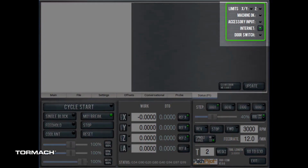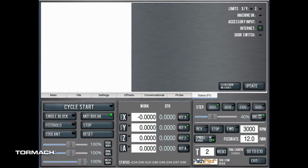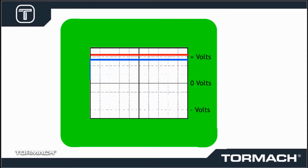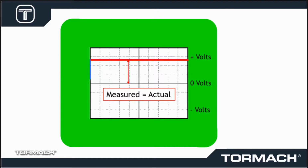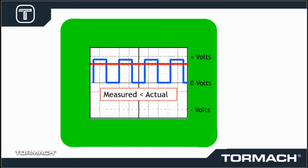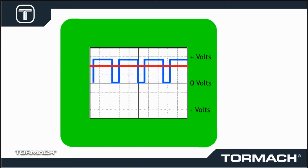Where the fundamental tests investigated reset and basic communication, the motion control tests will check spindle motion and table control signals. As many of us do not have an oscilloscope, we'll check for the presence of these signals using a digital voltmeter. These signals are direct current voltages, such as coolant power, spindle direction, and table direction, or square wave oscillating signals such as spindle speed or table motion. These signals may be frequency variable or pulse width variable.